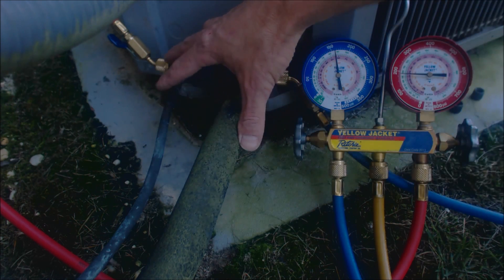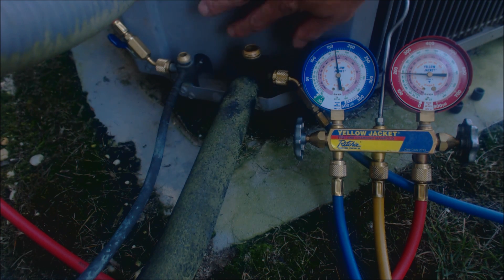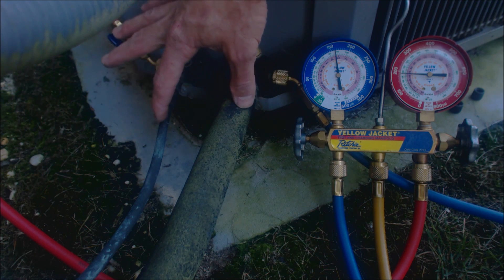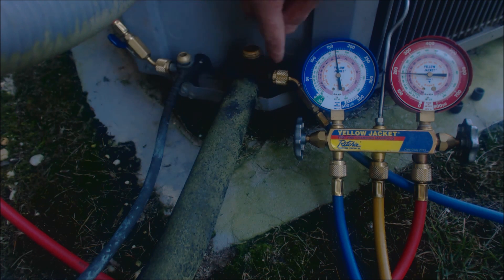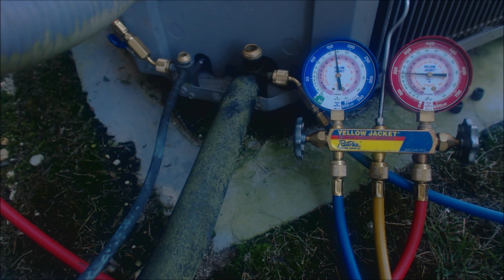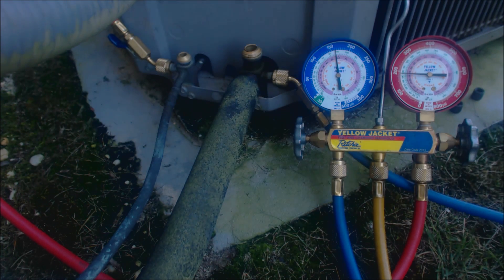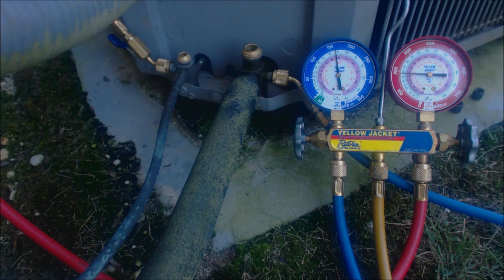Normally I would just pull all the refrigerant out of this unit. When doing a pump down you're making more work for yourself if you're going to end up scrapping the unit, because then you have to braze the ends of these lines and open the valves back up to recover the refrigerant — it's double the work. You can just recover all the refrigerant right out of it on site. Check the next upload video for the recovery of this unit. Hope you enjoyed it — we'll see you next time at the AC Service Tech channel.